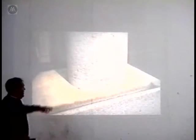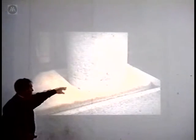Again, blemishes show they're there. And this is the joint between the base of the column, one of the Cambridge University buildings, and the column itself. The base has got a very functional property or functional purpose. It's there in order that the formwork for the column can be bolted into the right position. You produce the base first, with bars protruding. The base is called a kicker.